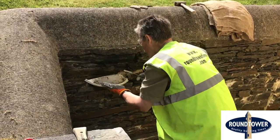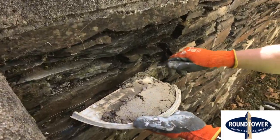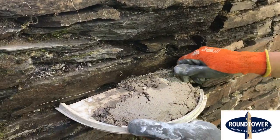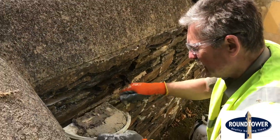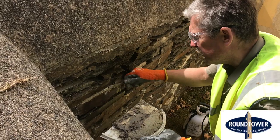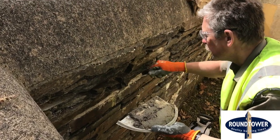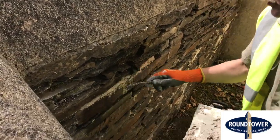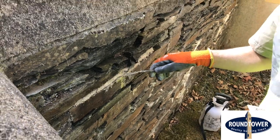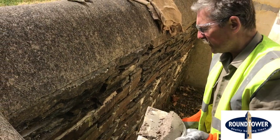So I continue on here — push it in well. Don't worry too much about smearing the stone. You can do it really slowly and carefully but you're not going to get much done in the day. The thing is, get it in there. Don't try to clean it while it's soft — wait till the mortar picks up and that'll clean off pretty nicely.